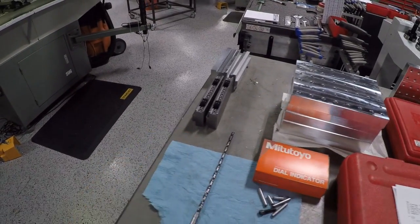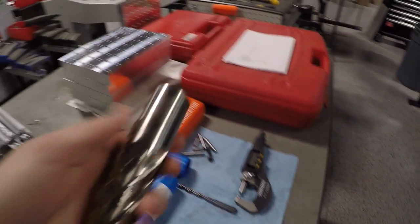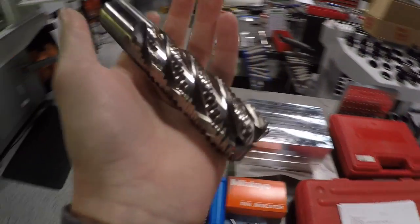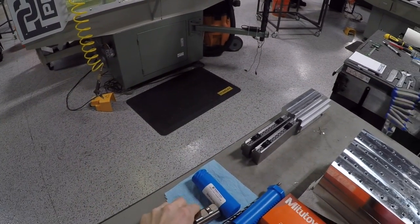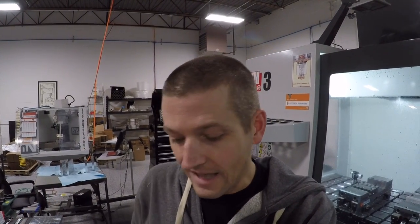Speaking of the Haas and big machines, we received two tools as gifts, which I thought were pretty cool. The first is this beautiful Niagara HBC one-and-a-quarter inch by six-and-a-half inch, six-flute end mill. Look at this thing — beautiful tool. I have a question: in the world of insert tooling, why does this tool still exist? I'm not saying it shouldn't — I'm asking why. That's so much expensive carbide, and the serrations make it harder to regrind. Why wouldn't you buy a shell mill where the inserts run up the side? You can rotate the inserts, buy different grades for different materials. Are these super popular, or are they being replaced by insert tooling?